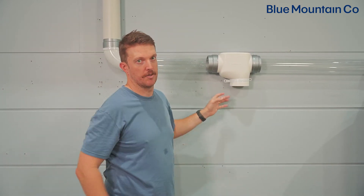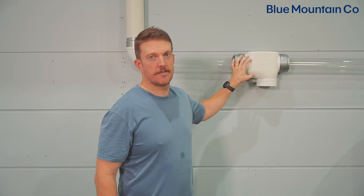This makes sure that the dirty water is captured by the first flush carrot and doesn't skip over the T to your tank. Now that the T is installed, we're going to install the upper collar of the first flush carrot.